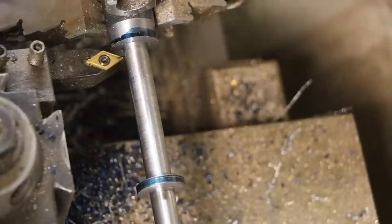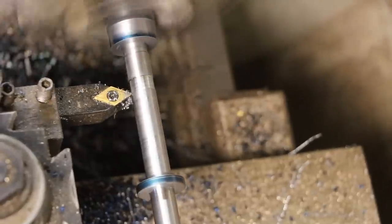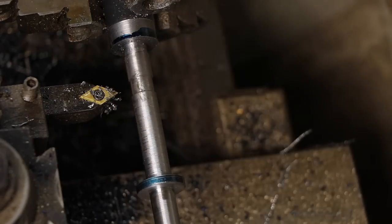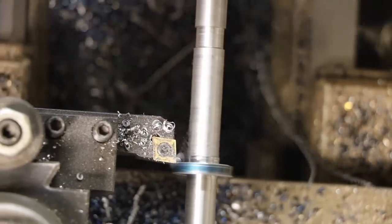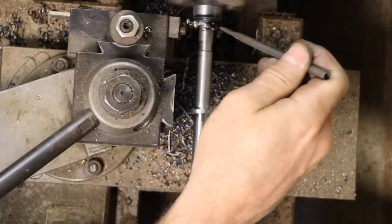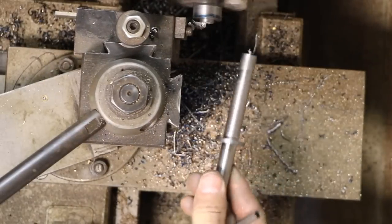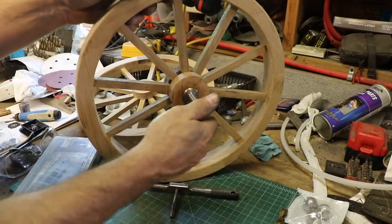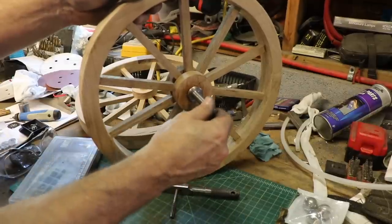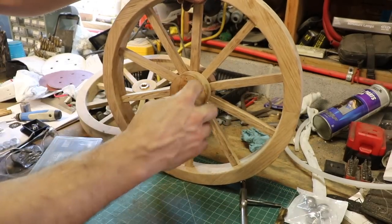I need to come in and make a journal for the set screw. That gives my set screw a place to live and hold that in place. Now I just need to clean up that shoulder. So there's one axle. This part's going to go in here — I left that proud so that it can rub there instead of rubbing on the wood. Then I'm going to have probably just a cotter pin, something like that, down here.